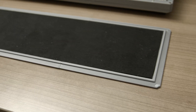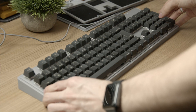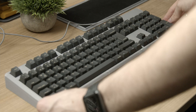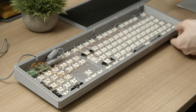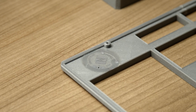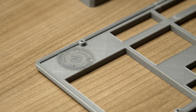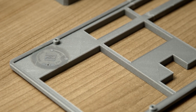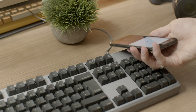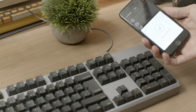The bottom plate was covered in soft fabric to dampen the internal sound echo at this size of keyboard. The case then clamps around the plate and keeps it securely in place, getting screwed together from the bottom, and the magnetic bottom plate attaches to the case from below. Before assembling the case, I added a rewritable NFC tag to the inside so that information about the keyboard — like the switches used and the microcontroller — can be stored on it. As I'm giving this board to my brother, he can now hold his phone next to it and get information about the board.